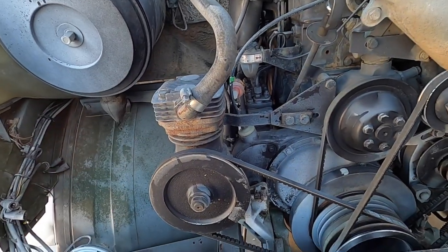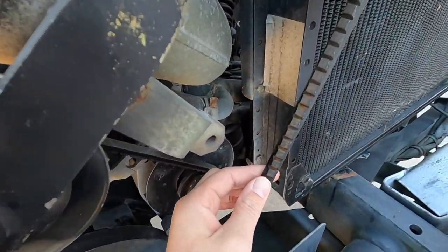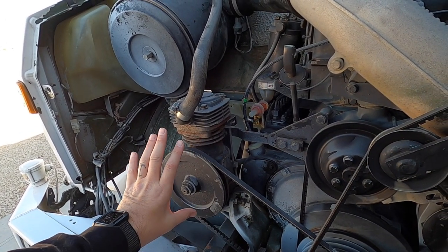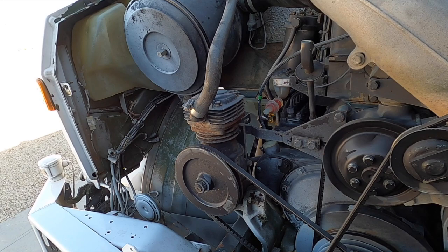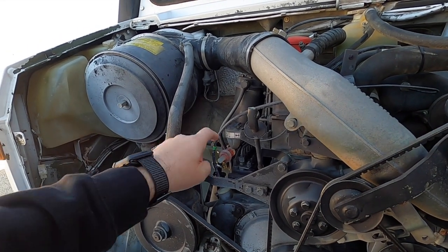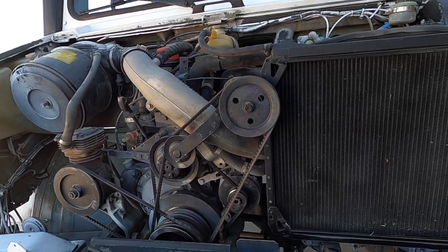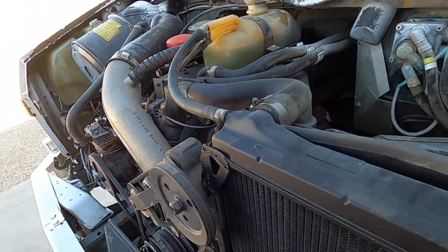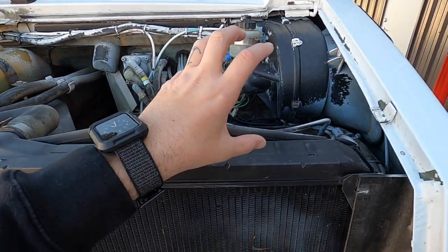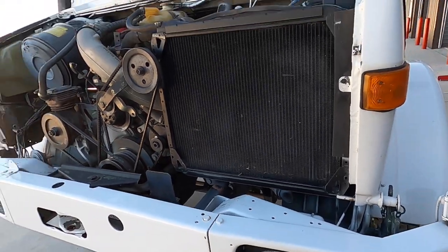Air box cleaner. This is your air compressor — when we got it there were a couple of belts out of adjustment, pretty loose. They're pretty dry rotted so all the belts are going to be replaced; I'll do a whole video on that. We had to scoot the air compressor over just a couple of millimeters — there are four little bolts and a tensioning bolt. Fuel filter, inline fuel filter. There's the ether. Check your oil — it's a six-cylinder turbo diesel. There's also the blower motor, which is pretty easy to replace. There's a step under here so you can gain access up there easily.